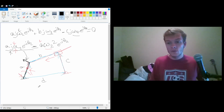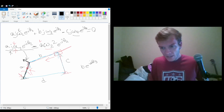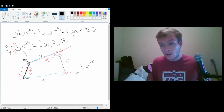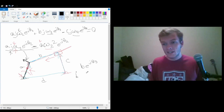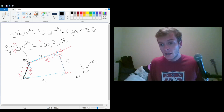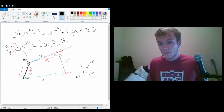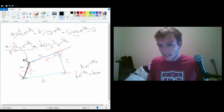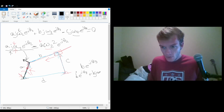What that means is when you differentiate the original B term, when we have e to the j theta 3, and we differentiate that, we have to use the chain rule here. So that means that we have our b dot, as we say. This means that it's the time derivative. So b's change with respect to time times e to the j theta 3. So you'll notice there's no j, there's no omega. And then this will be plus b j omega 3 e to the j theta 3.